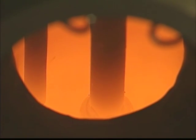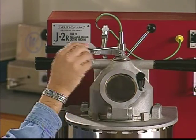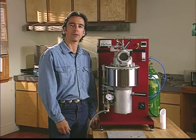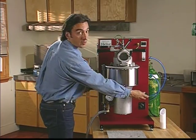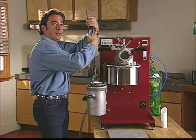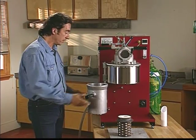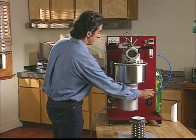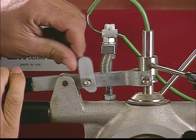Squeezing the release handle lifts the sealing rod and allows the metal to flow into the flask. Release the handle, which closes the bottom of the crucible with the sealing ball, and rotate the sealing rod adjusting knob several times to reseat the ball in preparation for the next cast. After casting, let the flask cool for about 45 seconds with the vacuum still on. Then lower the flask chamber by moving the locking lever to the left, rotate the chamber out, close the vacuum, and remove the cast flask. Set it aside to cool until the button loses its color before quenching. If you're done casting, open the valve to depressurize the line and then shut off the vacuum pump — this way oil from the pump will not be drawn into the line. If you'll be casting more flasks, now would be the time to charge the crucible with new metal. If you're done, lock the release handle in the up position with the locking lever, so the sealing ball won't stick to the bottom of the crucible as the chamber cools.